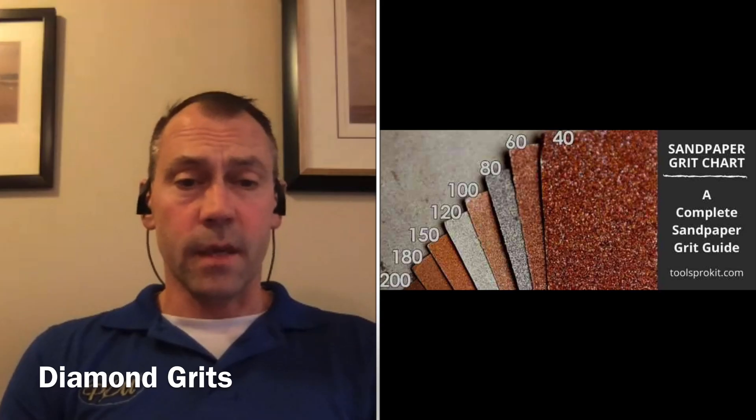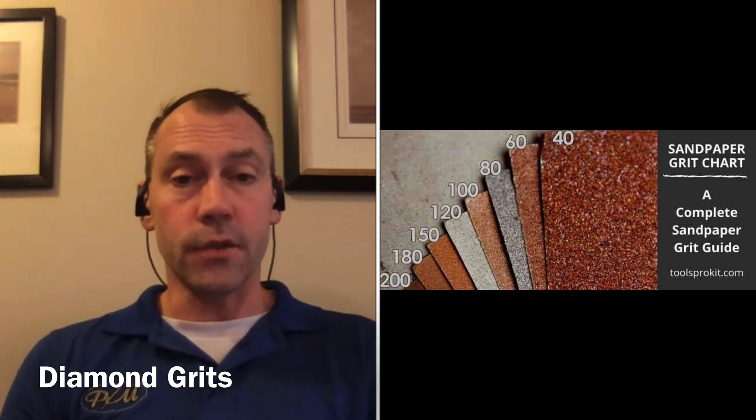So now we have the actual diamond itself being held together with the matrix. Let's get into grits. I've seen numbers from a triple-zero grit up to a 3000 grit on a resin — kind of go through what grits are associated with what diamonds and when you would use a particular grit. Are some grits exclusively with prep and others with polishing, or is there a crossover? With grits, if anybody is familiar with sandpaper, that's probably the most universal way to compare a diamond grit to something people can understand. The lower the grit, the more aggressive it is — same as in sandpaper.